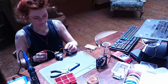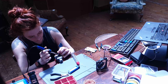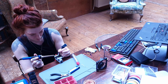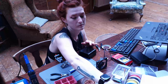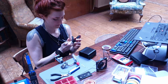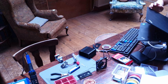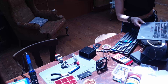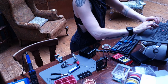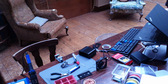The first thing I did was soldering the MAX485 module to the ESP32. There are three key connections: power, ground, and data. After that, I soldered the DMX port to the MAX485 module. Pins A and B from the MAX485 go to pins 2 and 3 on the DMX port, and ground goes to pin 1. Three wires and you've got DMX output. The wiring is simple, but you do have to be precise — one flipped wire and your signal either won't work or will act strangely. And if you don't ground it properly, some fixtures will flicker or not respond at all.